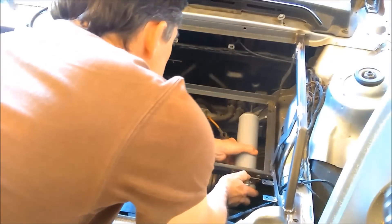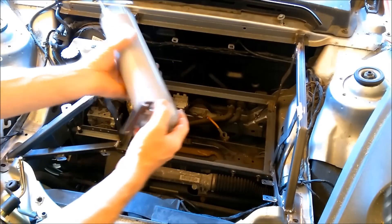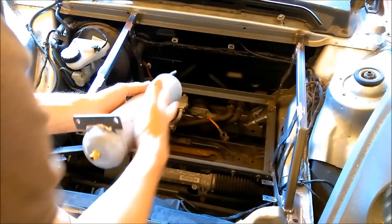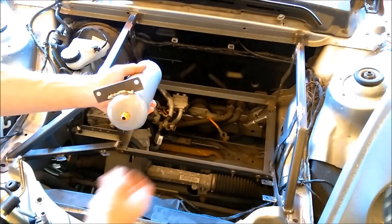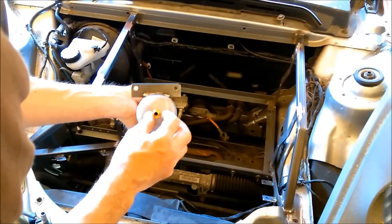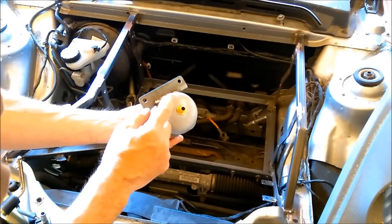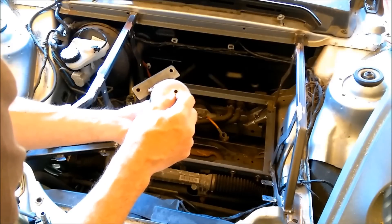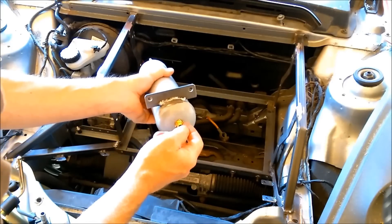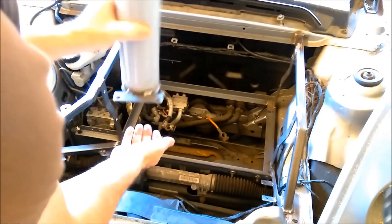The other thing is this here, which I've made from an old CO2 gas bottle from a MIG welder. I tend to hang on to these in case the metal is useful, but this one is going to make a great cylinder so that when the vacuum pump is drawing vacuum I'm storing some of that vacuum in there - a reservoir, if you like. I just need to get a fitting. I've made very sure this was empty before I did anything with it. There's a little release valve on the top there, and I've drilled that out to make the hole as big as possible. I'll just need to get an eighth BSP fitting on it; unfortunately there's a bit inside which is quite irritating.